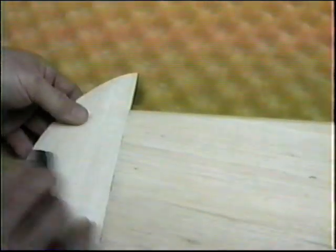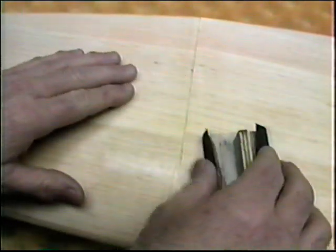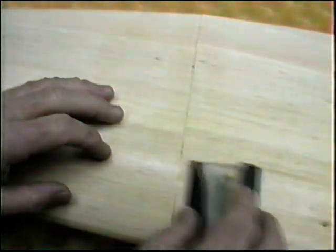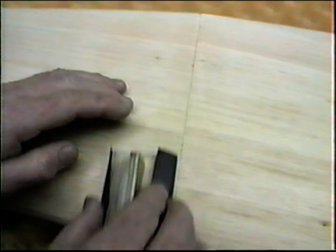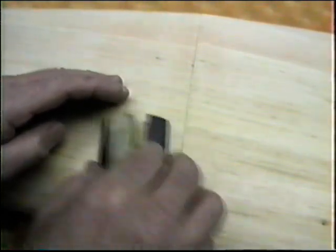Again, if you detail out the part right now, it just gives you a little bit of a head start on that over here where we have the big seams. This is where the seams, see how shiny that is from the fiberglass? Because the dope doesn't sit in the fiberglass. Now you can feel that seam, but I don't want to cut it smooth, because it's a mountaintop. So I'll just very lightly go over that and then work my way up on one side, work my way up on the other side, but not do this. You don't want to make that seam real thin. I don't want to cut through that. And then when this is done, I'll need to get one more coat of dope on this, get it outside drying.